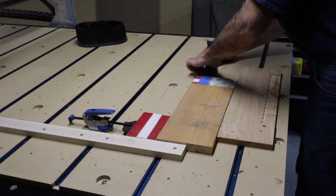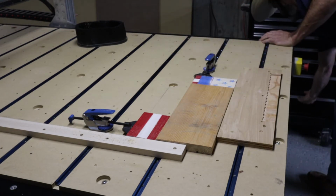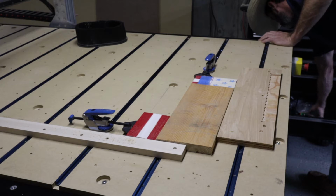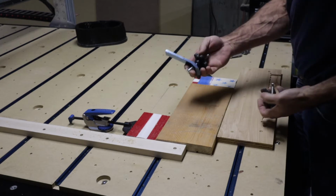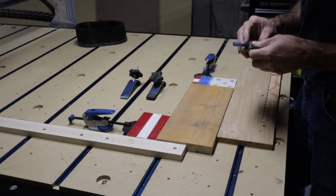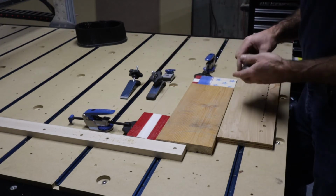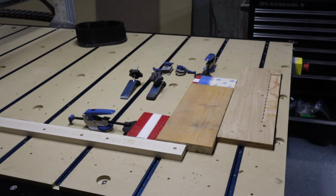But the number one issue is not having your material down, because if you go to do a V-carve or any kind of cutting, there are pressures side to side, and if you don't have it down well, you could run into catastrophe, and that's what happened to me. So I've learned to use these Rockler clamps with my T-track, and I make sure I have good side-to-side force and that it's not going to come up. I've become a lot more successful with this. So that's number one, material being fastened down to your table. Let's go to number two.